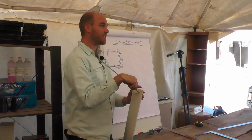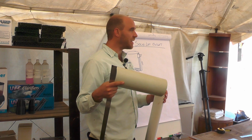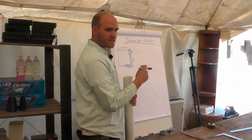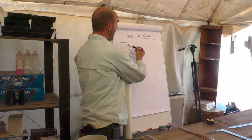To give you an idea, the maximum flow of 110 mil pipe is 10,000 litres an hour. So that gives you an idea that the bigger the pipe, the more it's going to flow, especially, I'm talking gravity flow here. Okay. So we know that this is going to be 75 mil, this is going to be 75 mil. One of the things that you're going to have is on a junction where my water is coming out, my solids are going to be moving very slowly by the time they get to this point. And that's why we increase the pipe to 110 and then back to 75 to allow it to flow through.